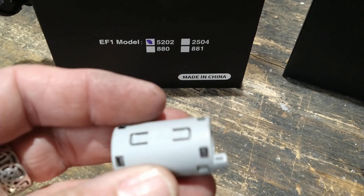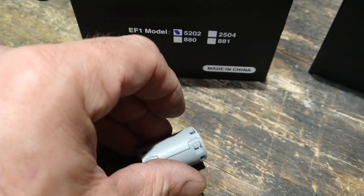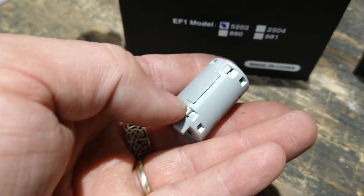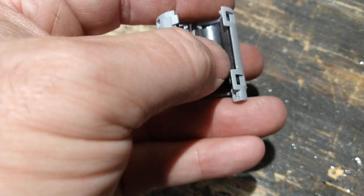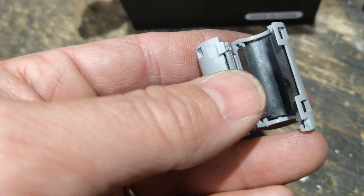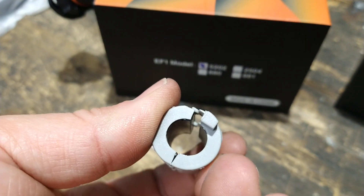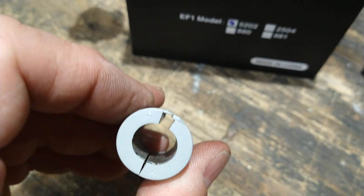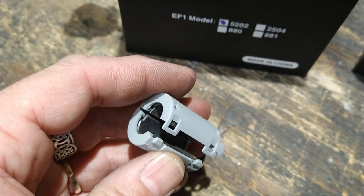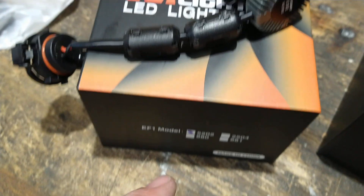Just in case you're not familiar with these, here's another one — it's a larger one, but I'll show you how they work. These two tabs, you just pop them open with a little screwdriver. They open up like a clamshell; you have a piece of ferrite on each side. You want to appropriately size it for your wiring. Now if this wiring were like a foot long, you could actually wrap it through two or three times because it's big enough. This larger one would be more suited to a larger wire — like a 110-volt power wire coming out of your wall; you could probably get two wraps through it. If the wire were longer, you could wrap it three or four times, and the more you wrap them, the more of that radio interference you're going to get out of them. But two of these should be sufficient.